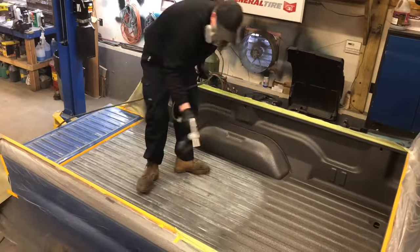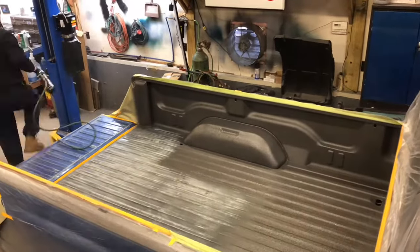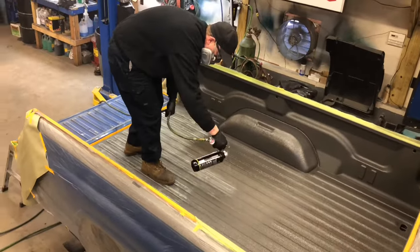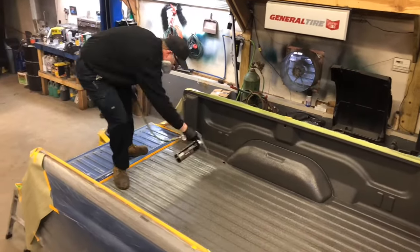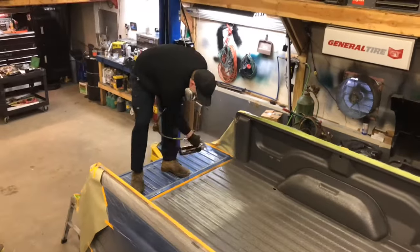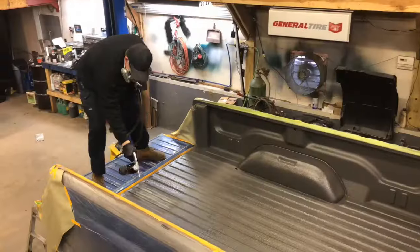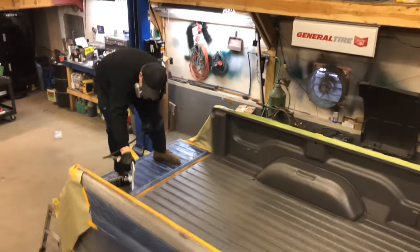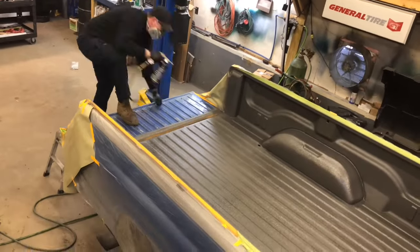That's not the time to start rushing once you start spraying. This stuff has a very good pot life — you can take your time with it. When you're spraying, start in the hard-to-reach areas: the nooks, the crannies, the corners. Get those sprayed, then work your way to the flat surfaces. Look at it as a grid — break it off in sections, do that section, and move on. With your spraying style, stay about 8 to 10 inches distance and do what I call a crisscross — go vertical one way, horizontal the next. That's going to help it lay down even and prevent a streaking effect where it looks shinier or duller in certain areas. Try to get a decent overlap — as you spray the line you just did, overlap it about 50%.